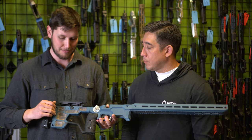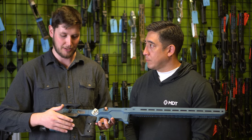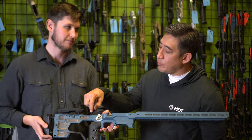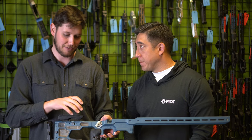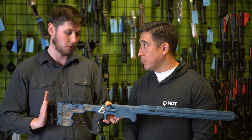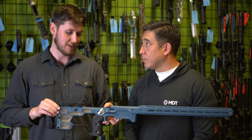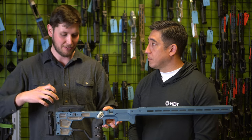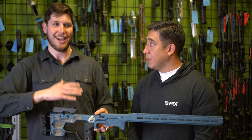The connection bar is completely modular — you can remove it if you don't want it. Some people hate the aesthetics or just don't want the bar, so it's entirely up to you. But we find it does help transfer recoil in a more solid feel, as opposed to having a hinge point. We did quite a lot of FEA testing and SolidWorks-based testing — applying a thousand pounds of force on the back to see what would happen to the buttstock. What we found is that under extreme conditions the old buttstock would flex in a much different way, and that difference translates to the shooter as additional accuracy.